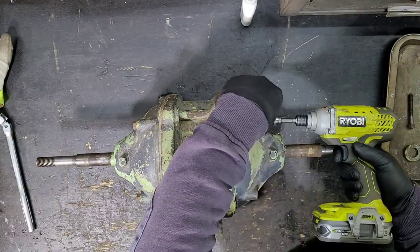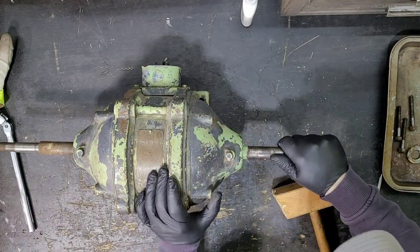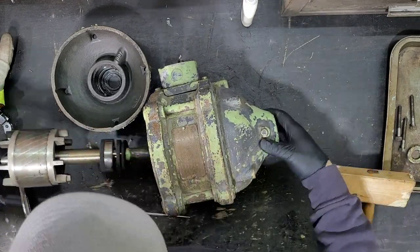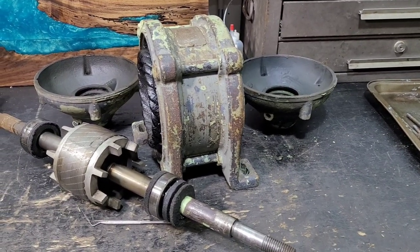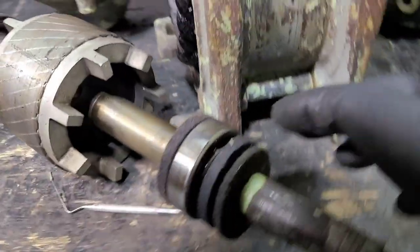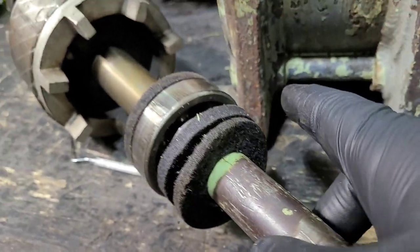So it's actually kind of a self-cleaning system. Now, taking apart the grinder itself, there are a total of eight bolts, four on each side. Once you get them apart you can get the sides off, and you just use a wooden mallet to knock them loose as they are a pressed fit. Here you can see the entire thing broken apart — you can see the shaft there with the bearing. And those black things on the side there are felt rings that go on there to help prevent the oil from leaking out the sides, keeping it in that bearing housing.